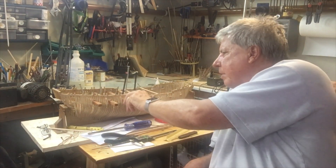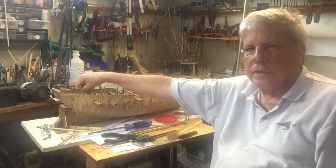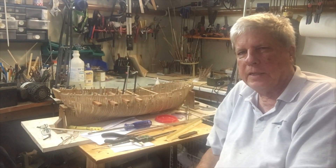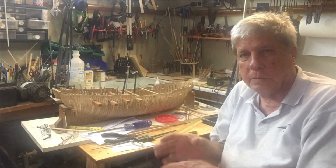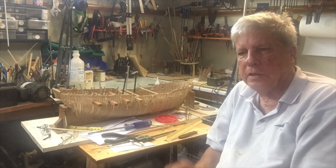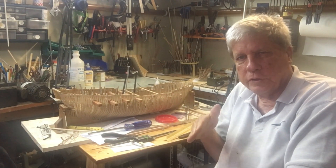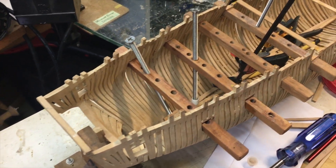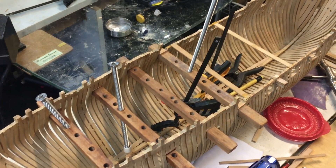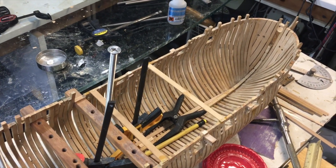The other thing that happened with all my fancy clamps is that on this one I actually pressured the top gun port sill out and I'm going to have to re-stick it. So it's meant to hold the piece in place, not force it in place. You need to let the bending of the wood and the drying of it in a new position happen over time, not force it into position. We're coming up to the 10-minute mark and I still have a lot to cover, so we'll break this into two sessions and I'll see you in the next video.